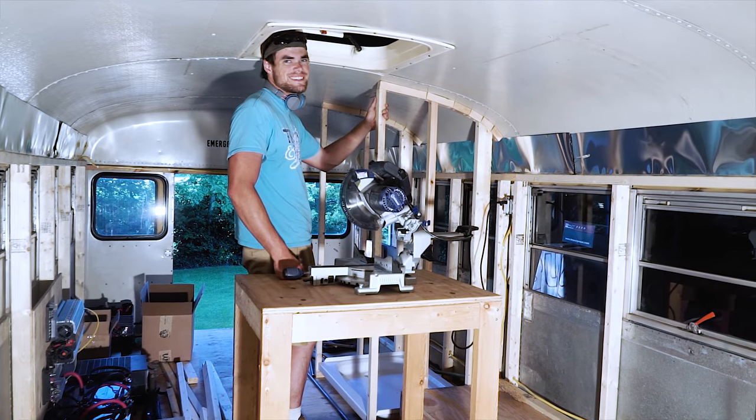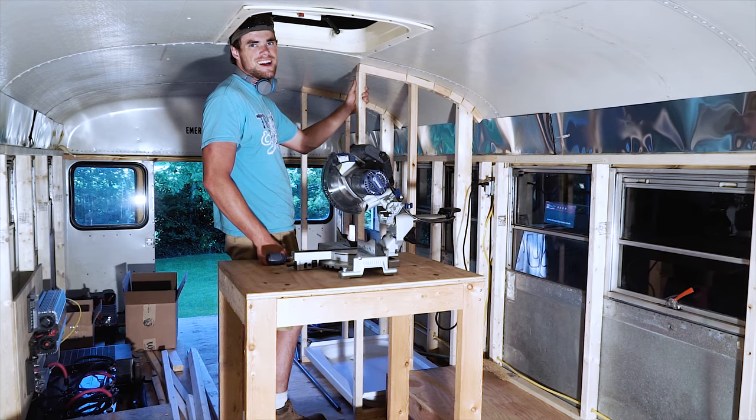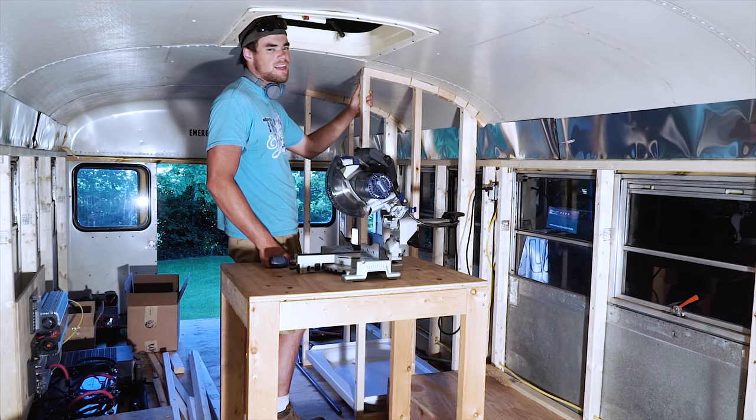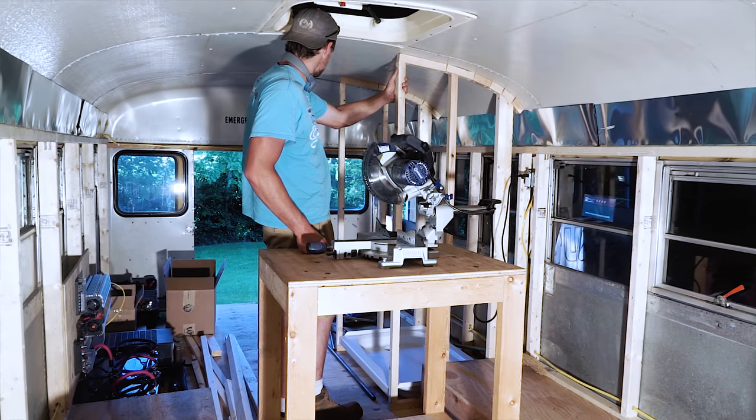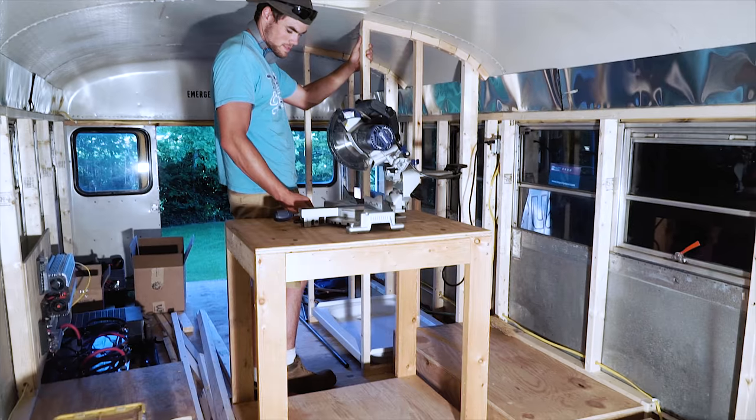Yeah, the light's dim because the inverter takes like a millisecond to catch up with the draw needs. So it has to steal the light power to be able to power the saw until it ramps up and the saw has full power and the light has full power.